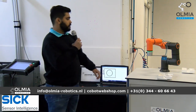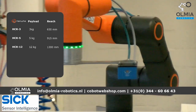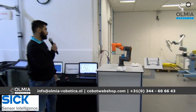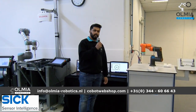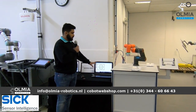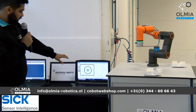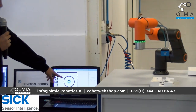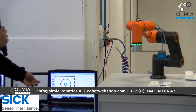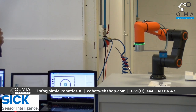Starting off, we have the SICK PIM60 2D camera, which is basically used for pick and place applications, inspection, measurements, and so on. The advantage is that the PIM60 can be easily programmable and it gives good results. If you see on the screen right here, the camera is doing an inspection of our assembly kit — we are detecting the small black rings. If the black ring is present it shows green, and if it is not present it shows red.